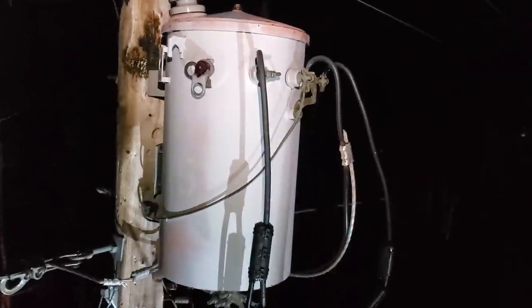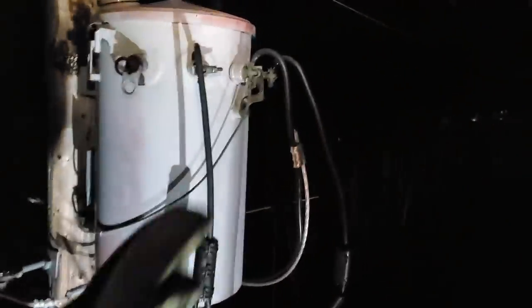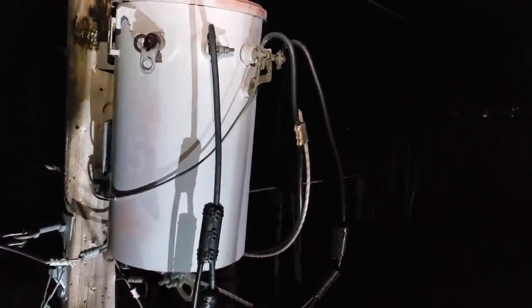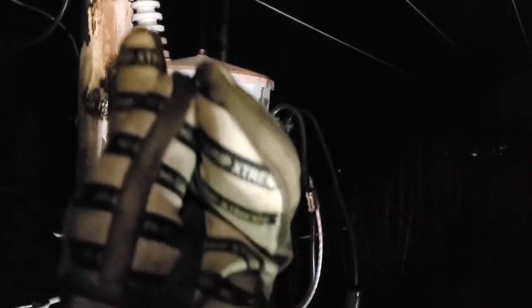See that over there? That house has their lights on — there's a generator running. I would assume that he has a proper transfer switch and that there's no back feed into that triplex. However, you can never assume in our line of work. So before we go into the high voltage thing, we're going to put a set of grounds on the secondary side. We've pretty much got three options: we can disconnect the secondary leads — these two outside live ones — we can short them out so that if there is a generator back feeding, it's not going to last too long, or we can go back to the house and pull the meter. What happens is that generator putting in 120 on this guy, 120 on this guy, goes backwards through the windings and comes out 7,200 on this guy.